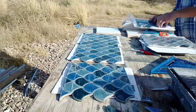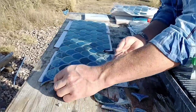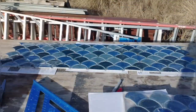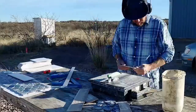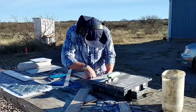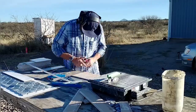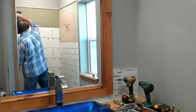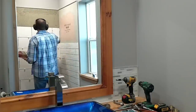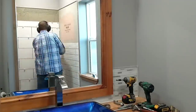Here I am doing my layout. I've got the top and bottom cut but they don't naturally mesh together — I have to remove some pieces from an extra square and fit those in so that it all makes a continuous pattern. Now that that's done I know exactly what height I'm dealing with, so I'm able to cut the white tile that'll go right next to it underneath to the right height so it'll all fit in the space I have left. Now I have my mortar base on, putting the grooves in, and getting ready to put on the last layer of white tile before finally putting on that decorative tile up top.